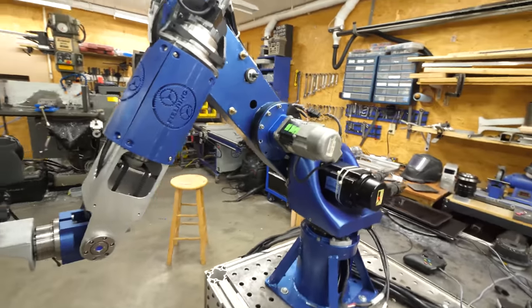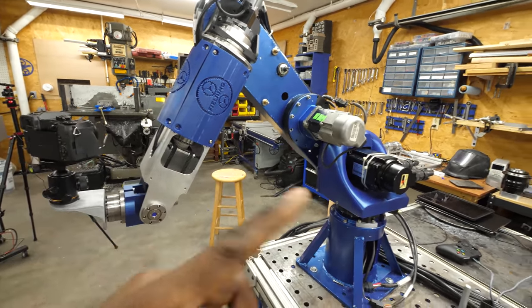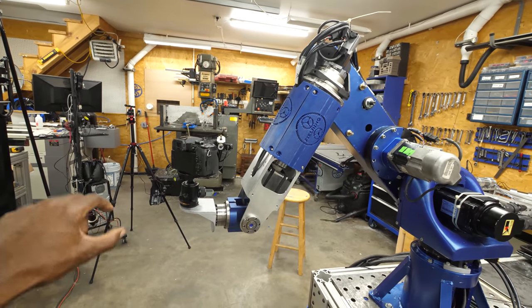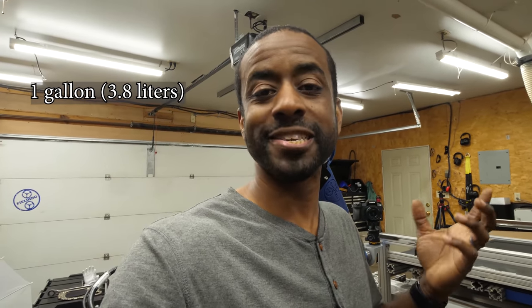One of the things that's really difficult to predict in advance is what the actual payload will be at full speed. I've done the math and realized that based on the torque available from each motor and the current gear ratios, I ought to be able to fully extend this arm to a little over one meter and hold on to a 30 pound, or approximately 14 kilogram, load. What gets tricky is when you try to accelerate the load — that produces additional forces. I need to make sure you understand just how much power it takes to swing around a 30 pound load. So go find a jug of water or something that weighs about eight pounds and pick it up.